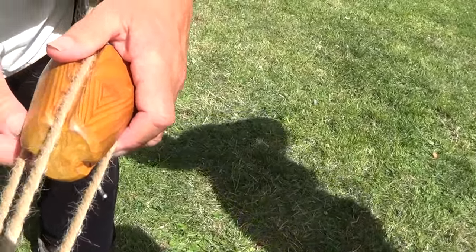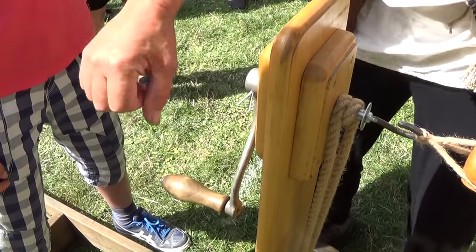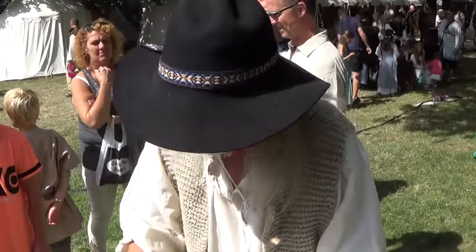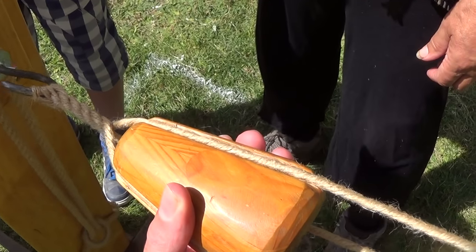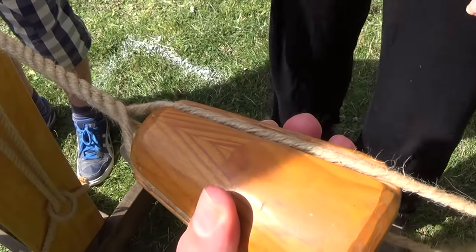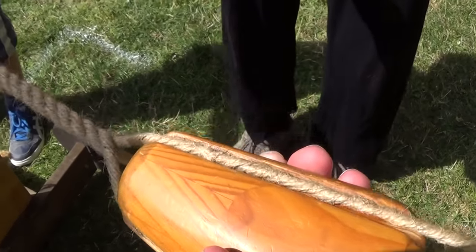Stefan is now inserting a device known as a top or topper — you'll soon see what this is for. My next job was to slide the top back at just the right pace to keep the strands forming into a rope at 45 degrees. The handle cranking the one hook is on wheels so that as the twisting causes the rope to shorten, the hook moves with the shortening. The finished rope will be about seven tenths the length of the starting yarns.